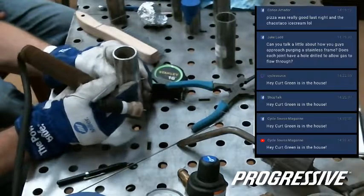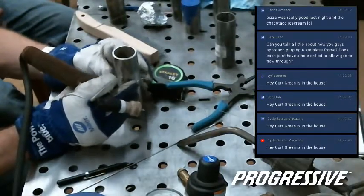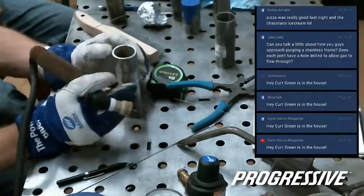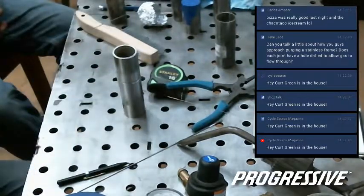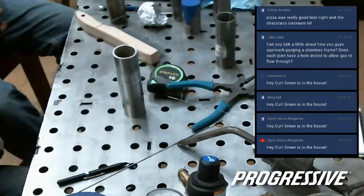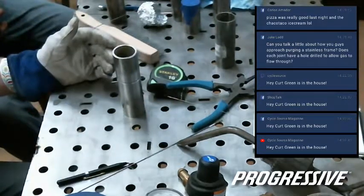And then I was talking to Brian about a couple little techniques I do. Sometimes you'll kick your machine on, everything will be set, tank will be on, and you'll strike your first arc, and it'll act all erratic and start blowing sparks everywhere. You didn't allow your hose to purge to the point of the weld. It was still back at the regulator. So I always hit the pedal a couple times before I start welding, just to make sure you're in good shape with all your gas.